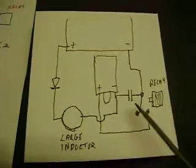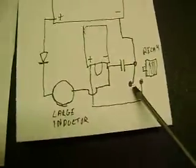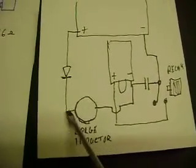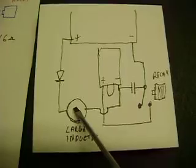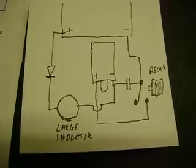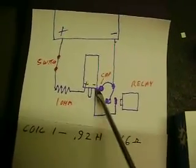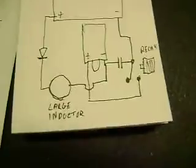It's a 1000-volt diode to keep the current always going forward. This inductor is 0.92 Henrys, 46 ohms. When the switch closes, current from the battery flows through the primary and through this large inductor and back to the positive. This resistance plus this resistance — 47 ohms — gives us about 0.28 amps max that the battery will ever see. We have the ballast resistor: 1 ohm plus 1 ohm primary in series, so we get about 6.28 amps there. This circuit is already way more efficient.